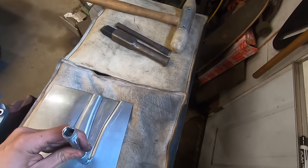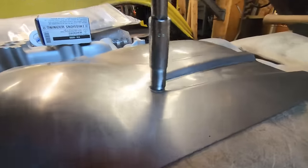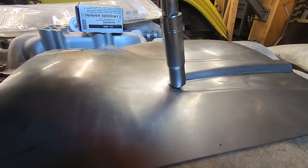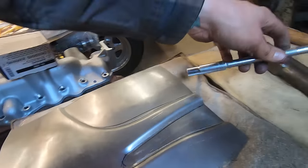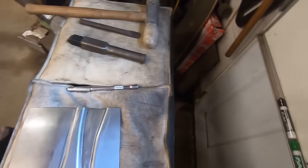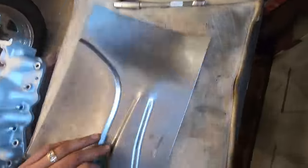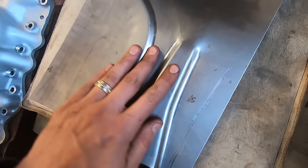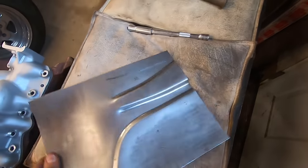my old 10 mil, put it right in there. Smack away, leaning more towards the back, so I don't get a full circular impression. We just kind of get the backside. And then touch it up with chisel. And the backside, since it's a softer curve on this, and it's a sharp inside here. See how it's like all soft lines? There's nothing getting chewed up like the inside of that, which, again, Harbor Freight dies are crap for.